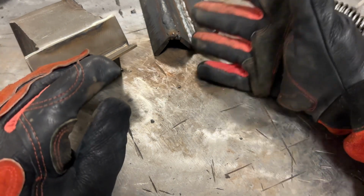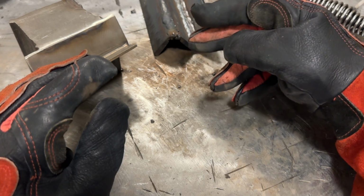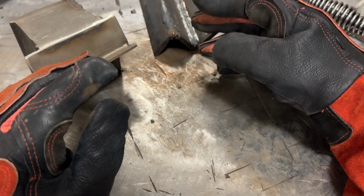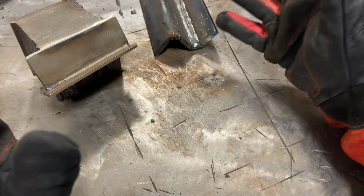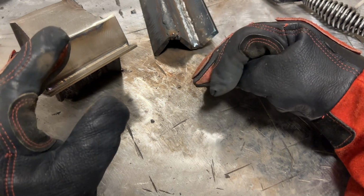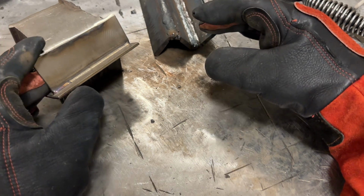I also learned, I'll put it in the mix here, that I need to weld with 3/32 rods more. I'm not as good as I should be with them. 1/8" rods, of course, anyone can lay a 1/8" 7018 weld good, but the 3/32s are harder. So if that's what you're working with, expect to have more of a challenge, I guess.